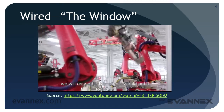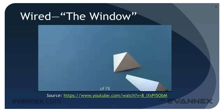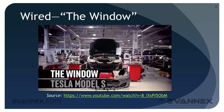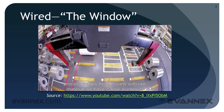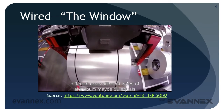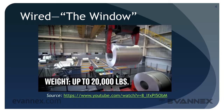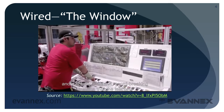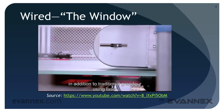From a manufacturing standpoint, the way we assemble this car, the way we put it together — all of this is essentially very different from another car. The Model S process stages all start with raw material. We have coils of aluminum, different gauges, different types of aluminum — maybe 50, 60 coils. We start the process by uncoiling the coils in a special machine called a blanking machine that allows us to flatten the metal first and then cut it into flat pieces called blanks.